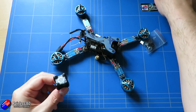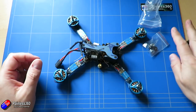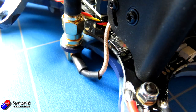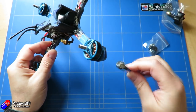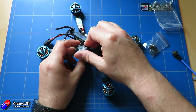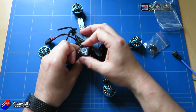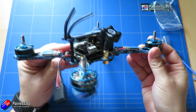The first thing to do is plug it into BetaFlight, but you have to work the antenna cable out of the way just to get a USB cable in — it's really crazy they've put a stiff cable right in front of that port. For the first test I'm going to move the antenna because in my opinion it's simply too low. Having it low is good for crash protection, but the idea of an antenna is to have it up away from the quad so it isn't obscured while flying. It's also a bit sad it's RP-SMA — I'll need an adapter since all my antennas are SMA and I've been a Fatshark guy for seven or eight years.